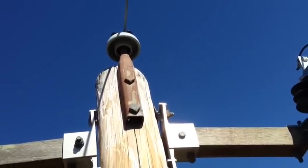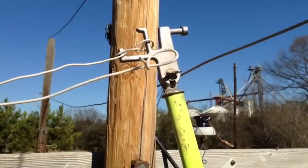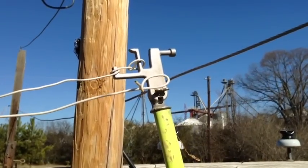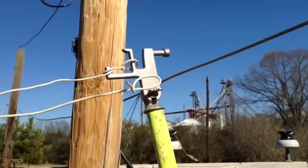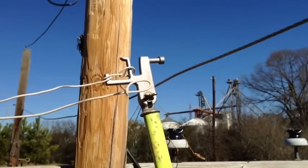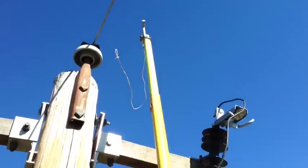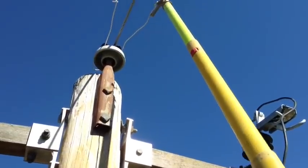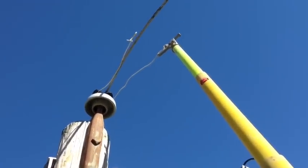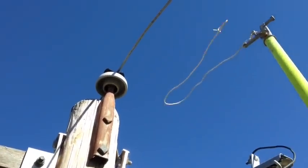We also have a tie wire feature. We'll give a demonstration of how a tie wire can be re-tied back in. It's not the easiest thing, but it can be done in inaccessible areas where you have damaged or rotten poles and you need to re-tie the conductor back in — it gives you a way to do it. Kind of like the old hot ties, you run this up, come on the back side of your conductor. You'll take two sticks: one stick holds it up, another stick grabs the loop, ties it in, and ties this side in. You've tied your conductor in and can save hours of outage time restoring power.